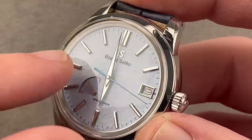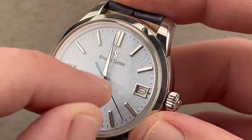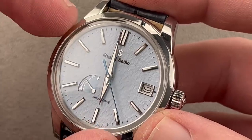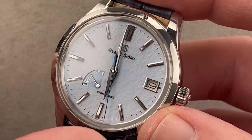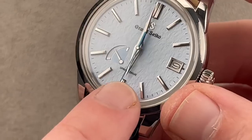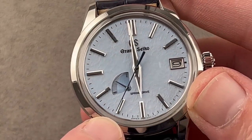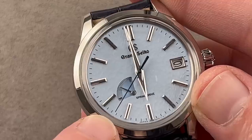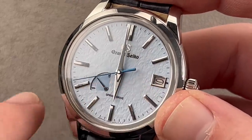All they do is create these little glittering man-made gems. The indices are then placed, along with the logo and date frame, on the dial manually by artisans who use acrylic tweezers and do all the work by eye. The seconds hand sweeps in a continuous arc — this is spring drive. There are no stops, no staggers, no beats, no ticks, no tocks. It's a unique aesthetic, and the hand itself is fire-blued steel. The Dauphine-style minute and hour hands are exquisitely mirror-polished and faceted.